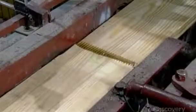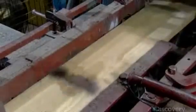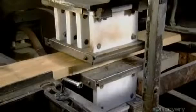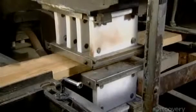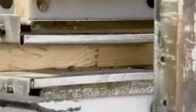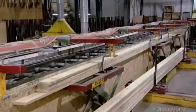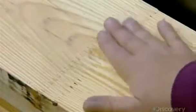Workers line up the glued boards in a machine called a crowder. The machine's pressure rollers slide one board into the other, interlocking the finger joints. Then 2 plates clamp down on each joint, rendering the adjoining boards flush, should one be sitting slightly higher than the next. About 15 seconds of heat cures the glue. The connection is barely visible because the glue dries translucent.